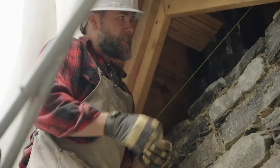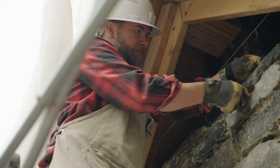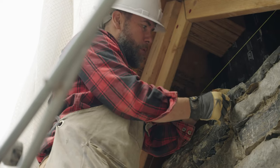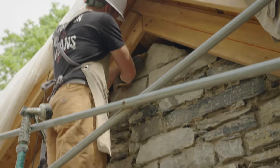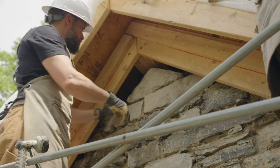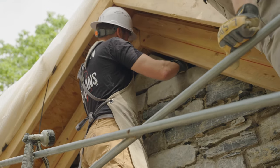We always use small stones to pin the wall — these are pinning stones. We'll knock these stones out but those stones will help keep the stone from crushing the mortar out. It's going to fit, but I'd like to see — Nate, if we could cut a stone shim that would come across here and balance this out a little bit better. When I put it in it'll be a little more pinched in there and a little more level and even.